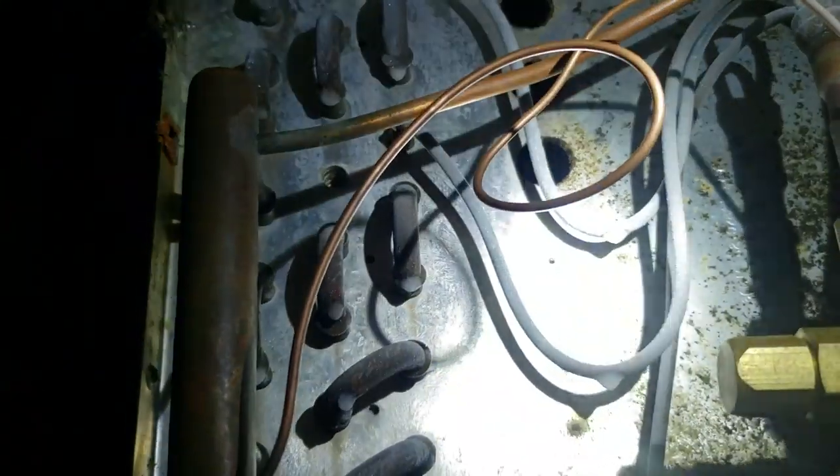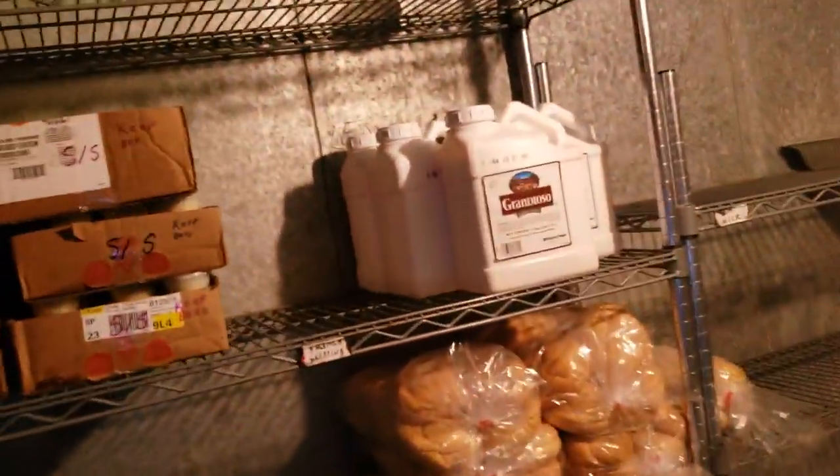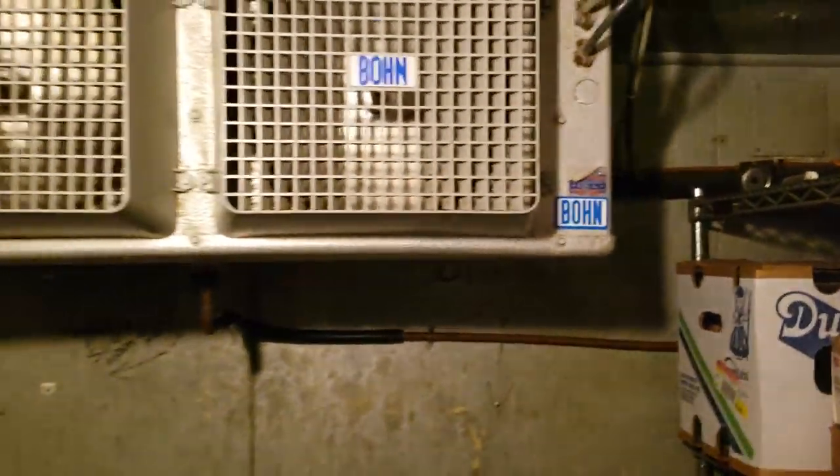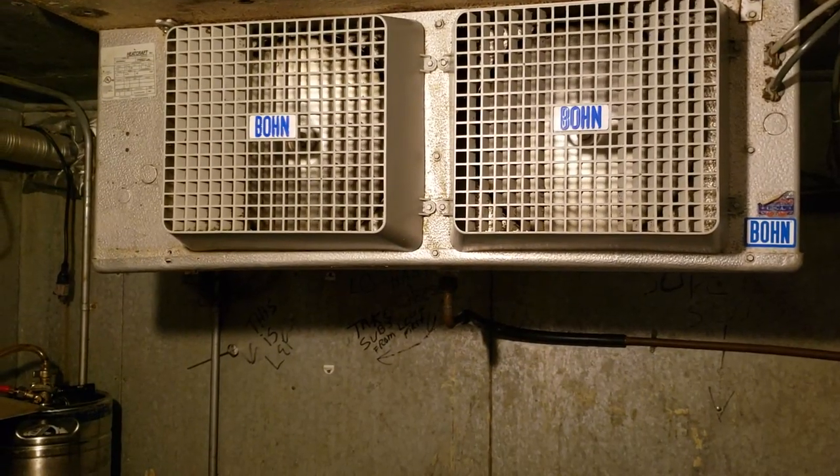She's dropping in temperature pretty quick. Looks to me like it's feeding pretty good. The cooler's pretty old, the coil's about ready to go next. The compressor was just changed earlier this year, so this thing's already been running on POE oil for a while.